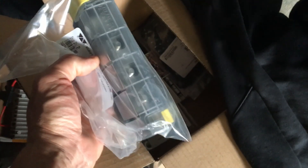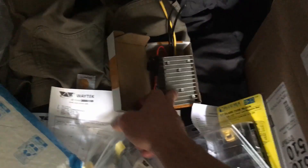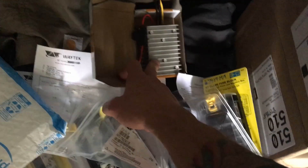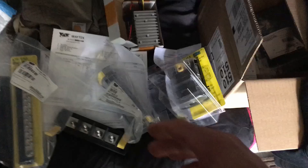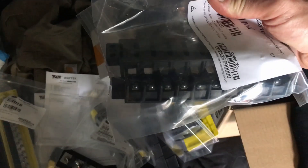I got to put in these components here. I got two of those, there's another one somewhere. These are breakers that go right in line into these things. I don't have to worry about having separate breakers because that battery has a breaker in it. Once I get those things hooked up, then I can hook this in - this turns the 48 volts into 12 volts, that will then power this, and that's where I'm going to get all my lights from. I ordered a bunch of stuff from this company. I got even more bus bars - I went bus bar crazy.